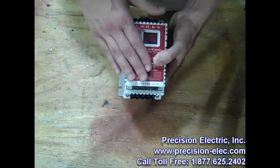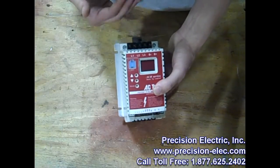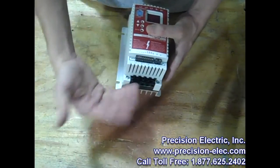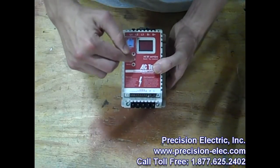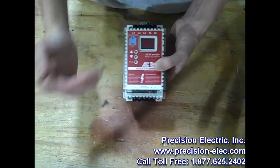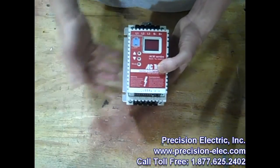That allows you to run a three-phase motor with single-phase power, which is one of the most common uses for this drive. The other most common use is energy savings — you bring in your standard voltage, whether it's 120, 240, or 480 volt, and you bring this out to your motor at 240, 480 volt, and you vary the speed or program one of the speed presets to turn down or up the speed based on criteria like pressure changes. So you save energy over time.